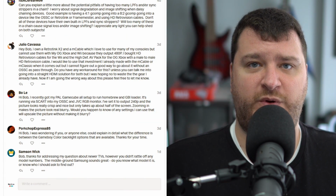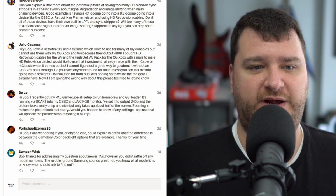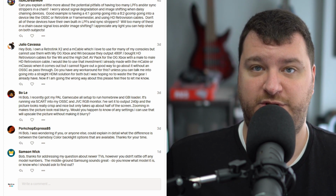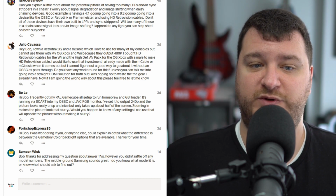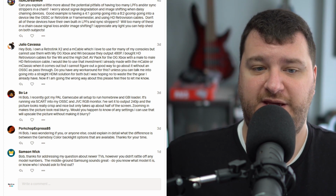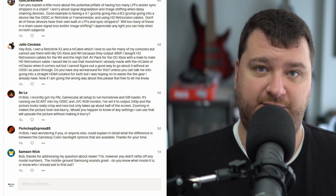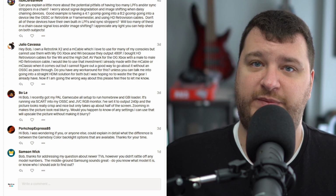So here's an interesting question from Julio Cavesa, and I hope I'm understanding this correctly, but I think he has a RetroTink 2X and an M cable, which he really enjoys, and he was hoping to use them with his original Xbox and Wii, and already bought high-quality component cables. I think the workaround for this, provided that you're playing 480p games, is that you just need to find a cheap component to HDMI converter.